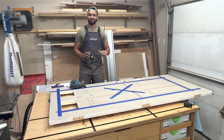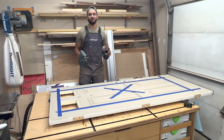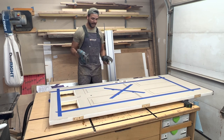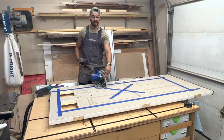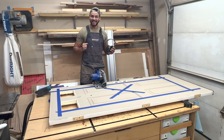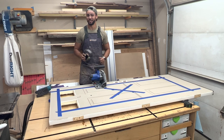We're kind of at the big moment. Zapotat recommends using a jigsaw to cut halfway through your door — don't go all the way through, that's where you get chip out. Things get really ugly. That said, I think that recommendation is because it's a very approachable tool for most people. I, however, have a track saw, which is going to do a much better job of cutting a straight line. I can set the depth to exactly what I need and ride the track, really eliminating a lot of the human error a jigsaw can introduce. Jigsaws tend to wander, so I'm going to use the track saw. Pretty nervous about making this cut — I don't want to have to buy another door. Just pray for me right now. Okay, thank you. Let's get to work.